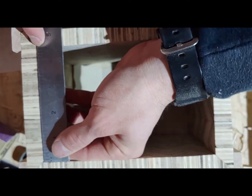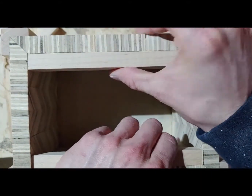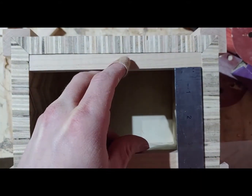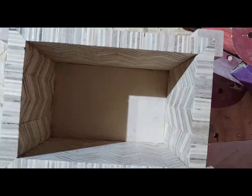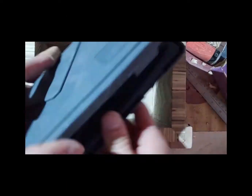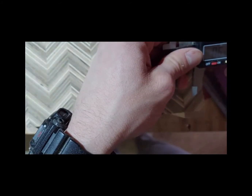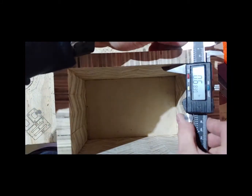Here I'm marking out the underside of the box — basically where I'm going to be creating a little ledge to allow the top to sit snug so it won't slide off. I cut out an inch by inch strip of maple, whatever the measurements were, and cut it on the miter saw. Then to make the top snug without wobbling but still leaving room for wood movement, I used my digital caliper and marked lines showing where to line up those pieces of maple.